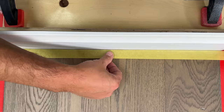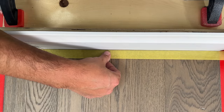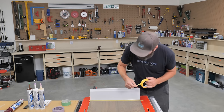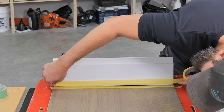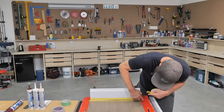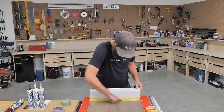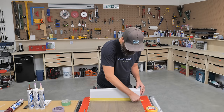Get right within a millimeter or less to the baseboard. On the baseboard side, the same thing — get it within a millimeter of the bottom without going past. Rip the tape off, and then before you get to the caulking, run your finger along where the caulking is going to go and press both tapes in nice and firm to the seam. You don't want any caulking to get underneath.